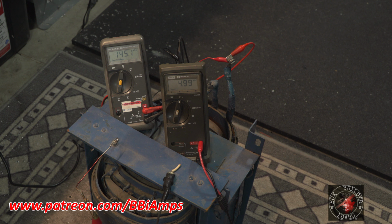Now the transformer's starting to hum a little bit. See why I had it on a Variac. It's a little too hot. Even for a 20,000, it's 1,000 volts too high. That's all right under load. If memory serves me, zero signal on a 20 is 0.6 of an amp. Absolute maximum rating, I think, is 6 amps worth of load. I don't think we get that out of this transformer. The secondary windings are too small. But it's doable.